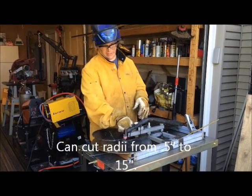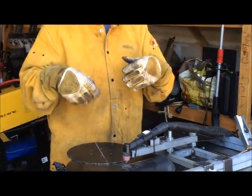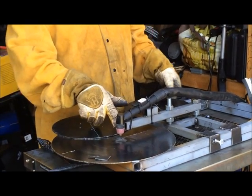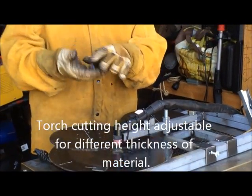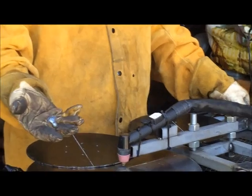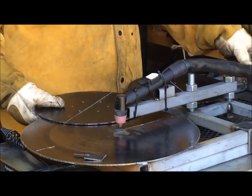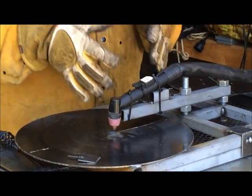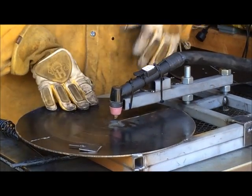Also, I don't know if you can see it, but there's this slit right here. I made a cut for where the head is, to help with the dross and slag accumulation. However, after doing it, I realized it needs to be wider — underneath you just get piles of slag that build up, and because it's narrow, it clings to the bottom and comes up from underneath. I went ahead and wiggled the head around where I'm working at the radius, and that's helped a lot. Eventually I'm just going to widen this and add a little more support so the heat doesn't warp it.